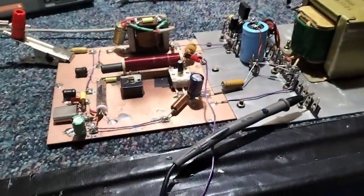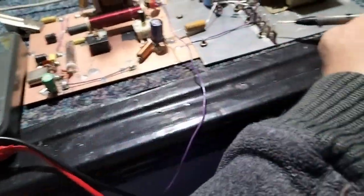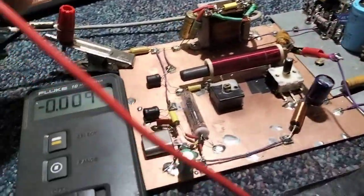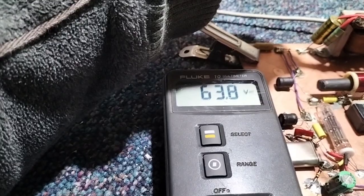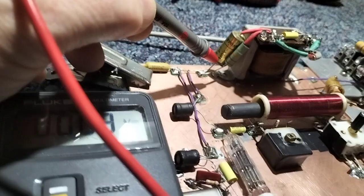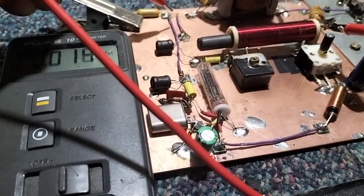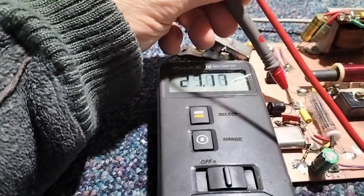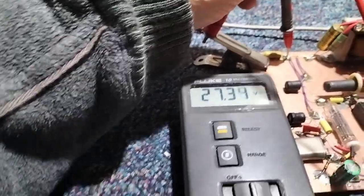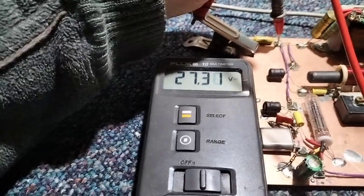This will really show you. This valve is supposed to run at a bit more HT, as we know — it's a proximity fuse for a bomb that the Russians, or the Soviets, had designed way back. HT is coming from the supply at 64.8 V, and on the other side of the transformer we've got 63.8 V going through a 22K resistor and a 1 µF cap down to the anode and the screen grid. We have to modulate both — you can just do the anode, but you need an awful lot more drive. Drive grid 2 and the anode and that's fine. The HT going to grid 2 is 27 volts. So we're running at 27 volts HT — basically in starvation mode, this valve.